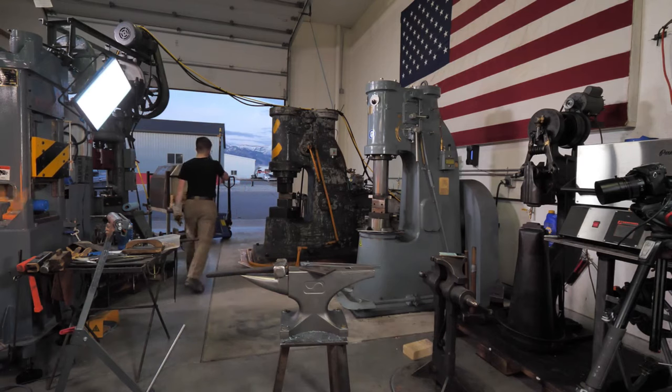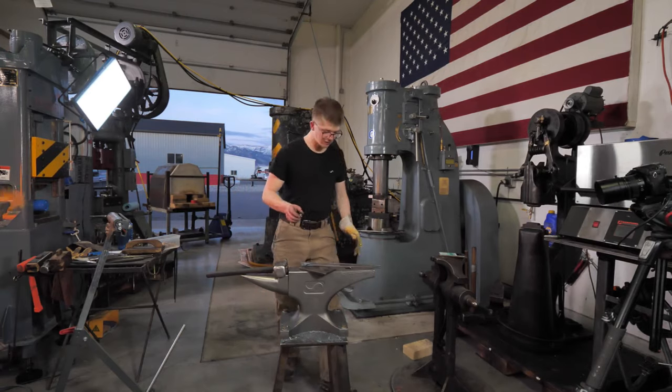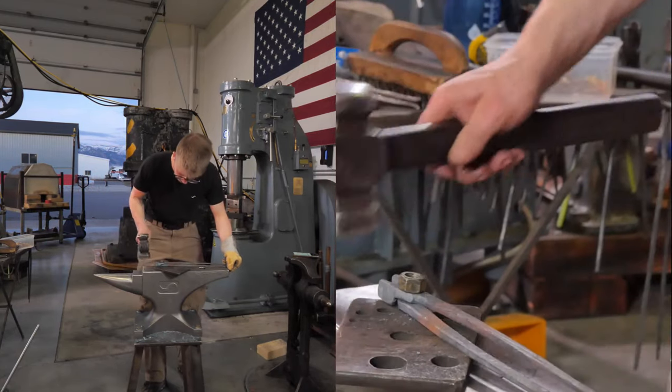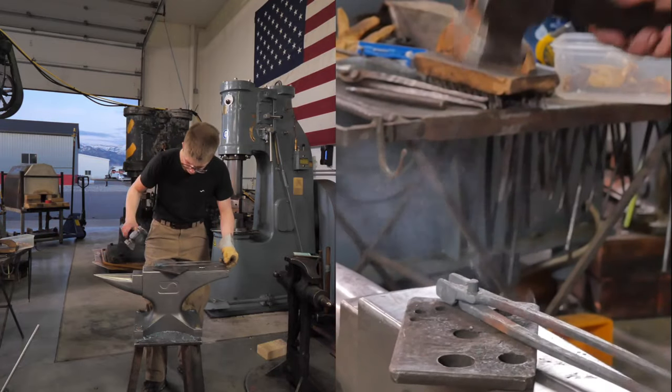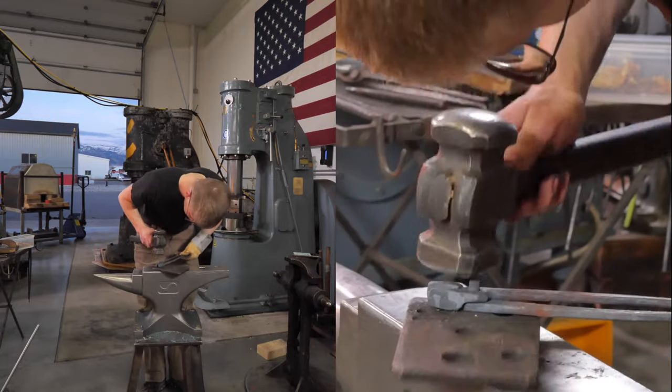How about we... I need a monkey tool. I think I left all my monkey tools in England. How else can I do this? Aha! A bolt head. These two halves of the tongs are not sitting flush. I'm taking this bolt head. I'm just gonna give it one big quickity-wickity whack. What? And now we're gonna heat it up and just hammer the thing shut.